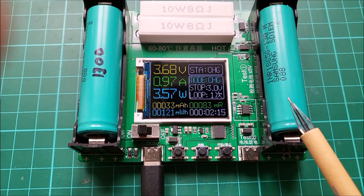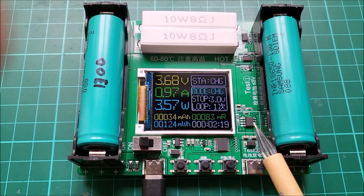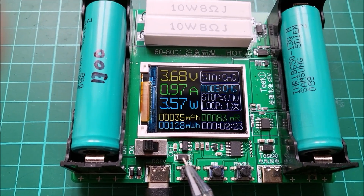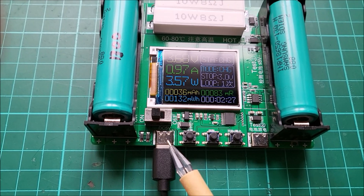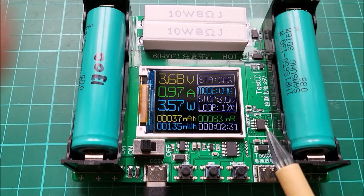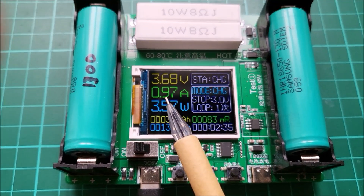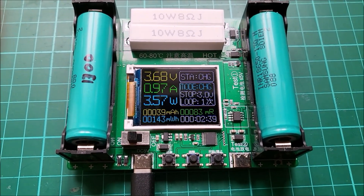So that's what gets warm when you're charging this cell. Here's the TP4056, the little 8-pin small outline package. And the diode that was getting warm is this one — the current from the USB Type-C connector is obviously going through that diode into the TP4056. That's set for 1 amp — you can see it there, 0.97 — and the cell on the right is being charged.